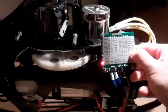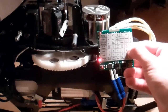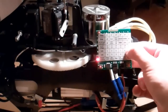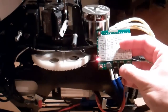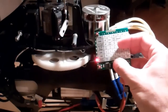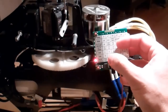And under special functions, this is important when you're actually in the Vbar program to make sure that when you're running through the program using your collective to control the throttle, you'll see that in Mr. Mel's videos, very handy videos to watch. You'll need to do it at that point, and you'll put your stick to off, and you'll click the button when it's here, and then you can put your stick to full throttle and click it here. Of course, the throttle is being controlled by the collective at that point.